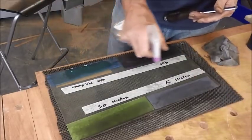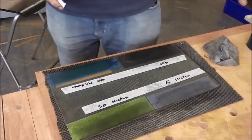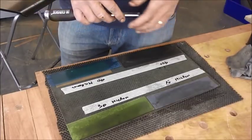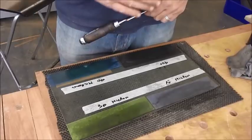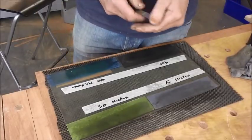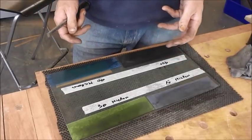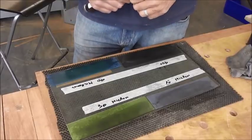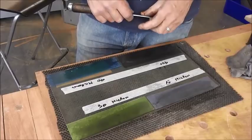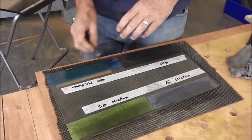The reason I've gone over to this is because otherwise I'd probably have to go on to wet waterstones. Doing this sort of work on waterstones can abrade them quite badly and they end up having to be resurfaced. Particularly when I have a whole load of students all doing this on a course, if they were all working on waterstones I'd be forever flattening them and they'd wear away in no time. So using this lapping film means you're not affecting the waterstones.